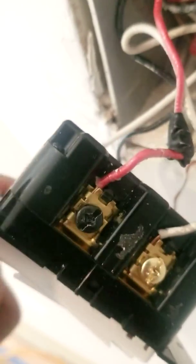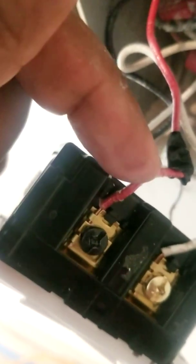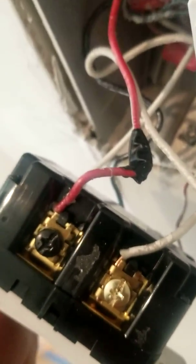What I have is a second traveler wire. If you're an electrician you can probably guess it — I have that wire on the same terminal as my line-in wire. So this is on the same terminal as my line-in wire on my remote side. I have my line-in wire terminated on the BK, and I have my second traveler wire on the same terminal, so it can send my line-in signal to this side, because these switches have to have power.